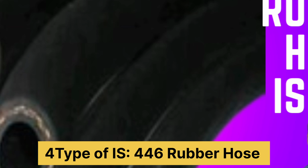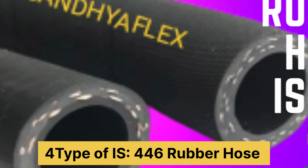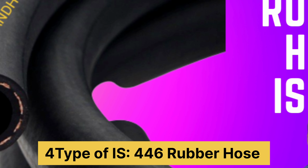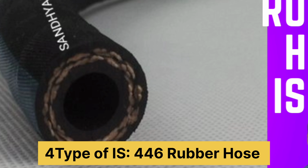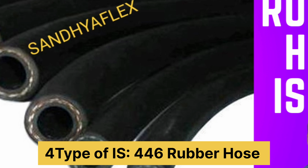Lining and cover thickness. The thickness of the lining and cover of the hose, when measured according to the method prescribed in 4.2.2 of IS 443/1975, shall be not less than that supplied in Table 1.